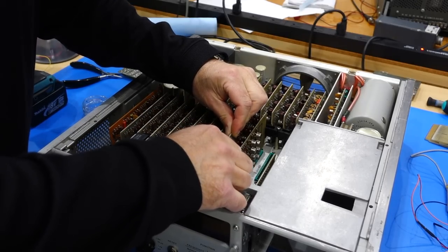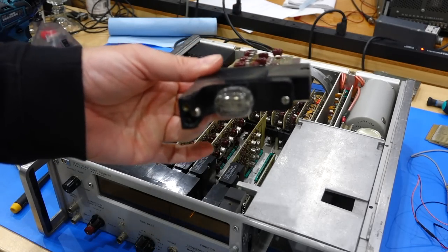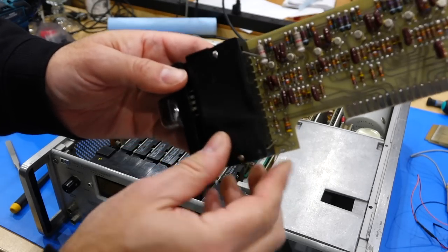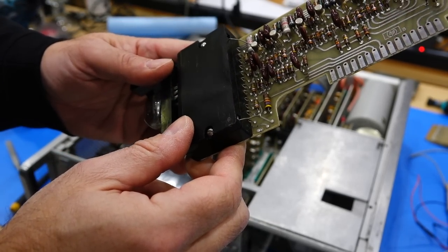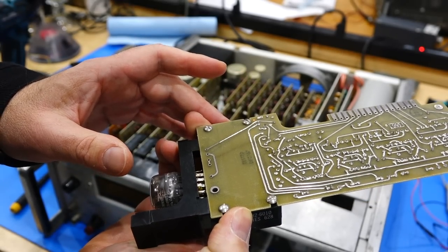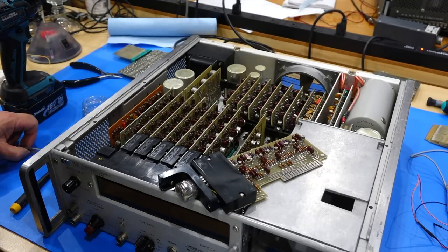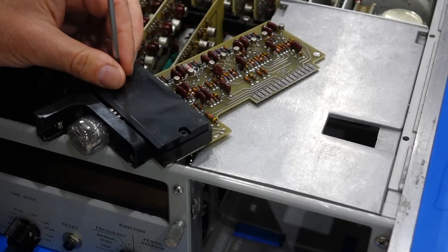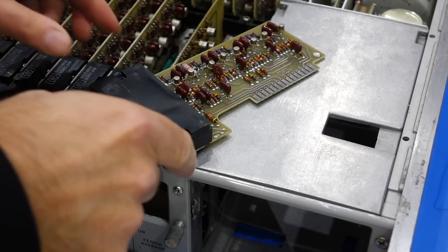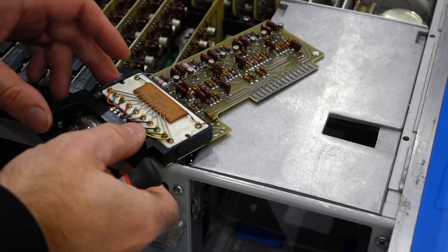We get to look at one of the Nixie counters. Woohoo! So you have the Nixie at the front, and I suppose here is where all the neons are, which actually might give us a nice visual clue of how the counter is working. It should, right? It should light up a neon and an anti-neon for every flip-flop in here, so maybe we'll learn something. The neons do two functions. They are used for the decoding, the BCD to Nixie decoding, and they are also used for memory. And they are underneath, so we won't see a thing.